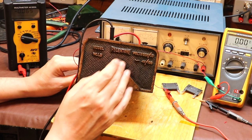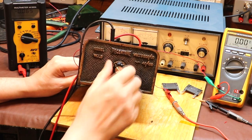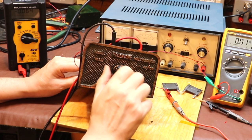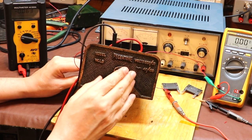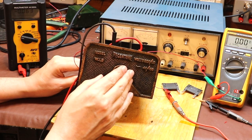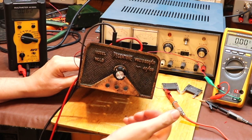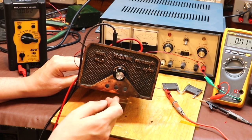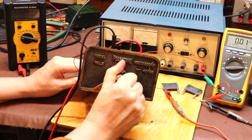I have to say, I really am quite surprised at how well this compressed graphite control actually works. But again, the only thing to bear in mind is the operator acts as a regulator, so this isn't a regulator. You actually have to adjust this to achieve the voltage that you want, and if the mains voltage went up or the current consumed by your wireless set went down, the terminal voltage would go up, so you would have to manually just turn it down a bit.